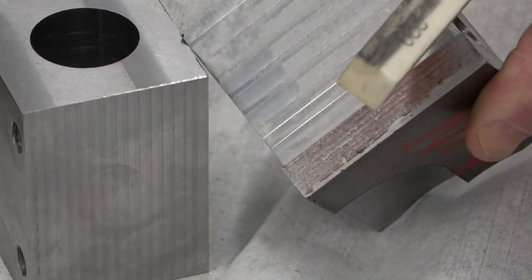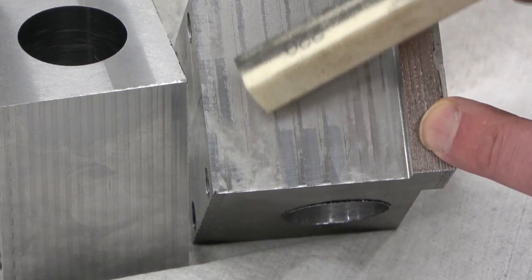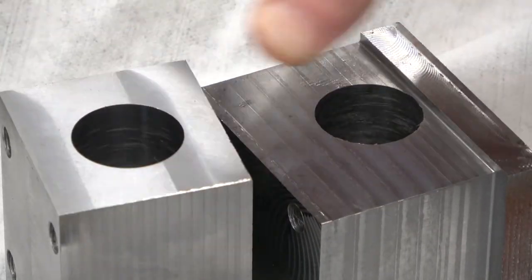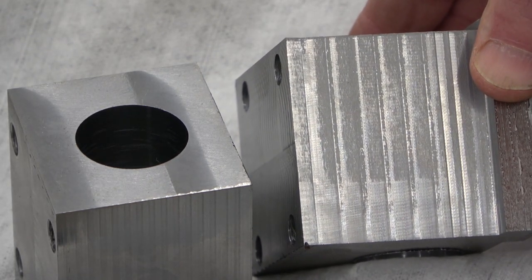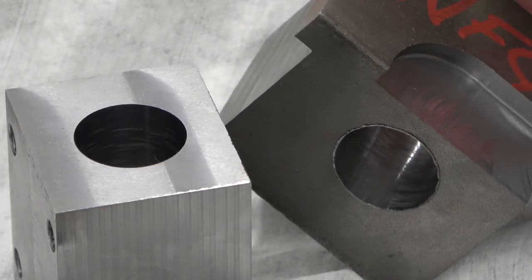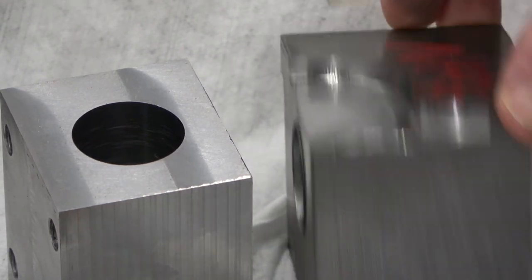Now you can see I was quite aggressive on the prototype there, or the fuck up, quite aggressive, and you can see it chewing up and recutting. So instead of quarter inch drops, what we did was 1/8, and then we increased the speed of the tool, the RPM, and we increased the feed, and that seemed to take tinier bites and less chance of it popping out. You see, when it did pop out, it was taking this a quarter inch chunk.